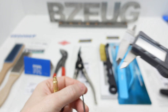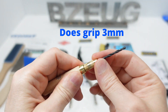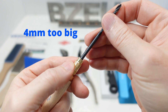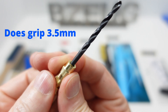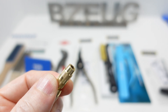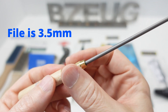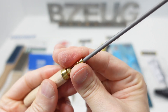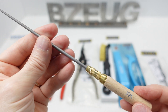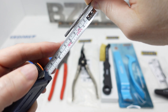Here's a two and a half millimeter drill bit — does it clamp down on this? Yes. Okay, three millimeters. So what is the maximum size? A four millimeter does not fit. You might be able to get just a little bit bigger than three and a half but not by much. So those are your limits: three millimeter to three and a half. Grabbing a Swiss file here — this Swiss file fits in there very well. Nice smooth collet, nice and solid, no sloppiness. The fit is just perfect. Checking the depth on this — that is 50 millimeters or two inches.